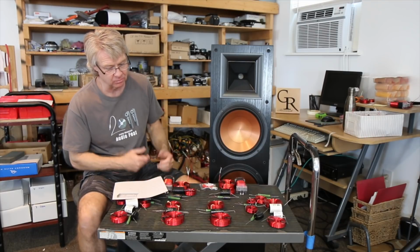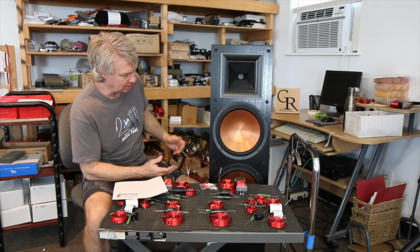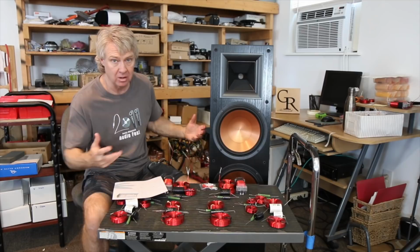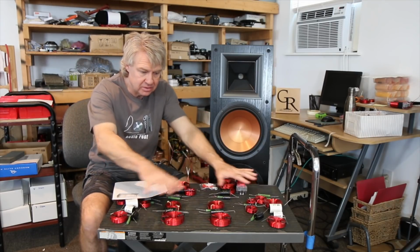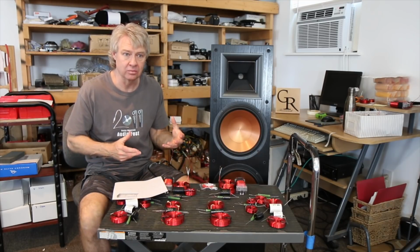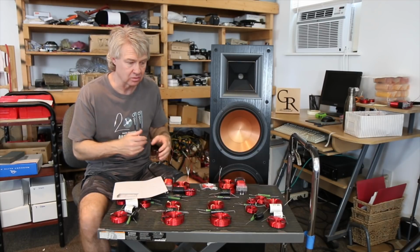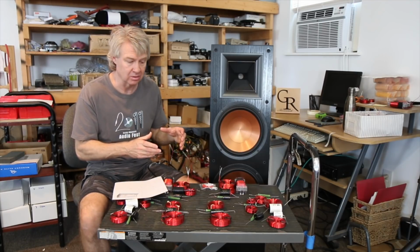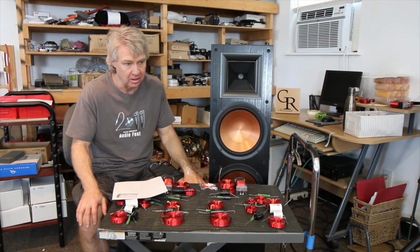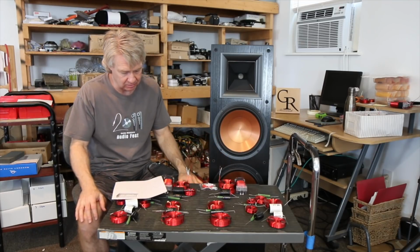It was just fortunate, really, that I was able to do that, but unfortunately, it took a lot of parts to do it. Again, I would tell Klipsch, if they sent this speaker to me to design a network, go back and fix the response problems of the drivers, and then it doesn't take this number of parts to correct it. That's why with a lot of our drivers, when I design them, I work on those and try to get a natural smooth roll-off, like in our XLS Encore and many other kits that we offer. You'll notice there's just 2 parts in the network, and 2 parts is all it takes to get that woofer to create a nice, perfectly smooth roll-off. Same thing with our tweeters. When you've got a tweeter and the response is all jacked up and all over the place, this is what you wind up with. This is what it takes to fix it.